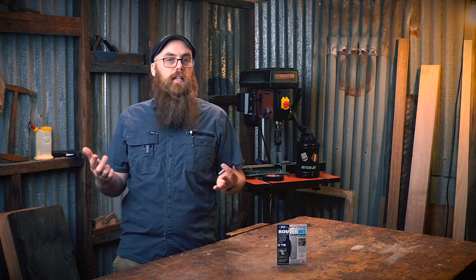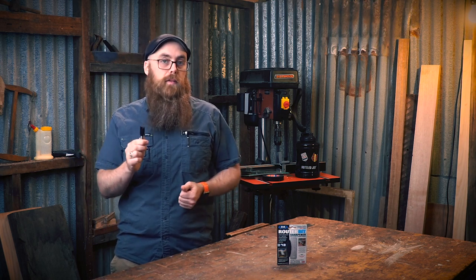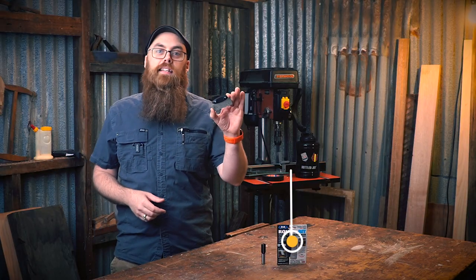You want to make sure you get an equal number of passes per side so the sharpness is the same for both — or all three, if you've got a fancy cutter. If one side is sharper than the other, it'll cut more efficiently on one side and leave machining marks on your workpiece.